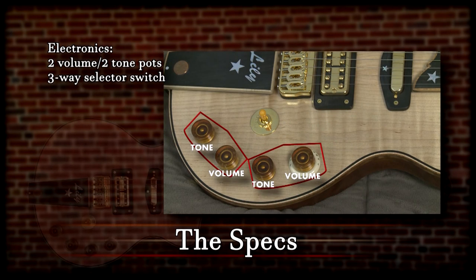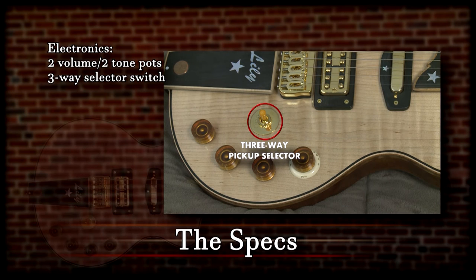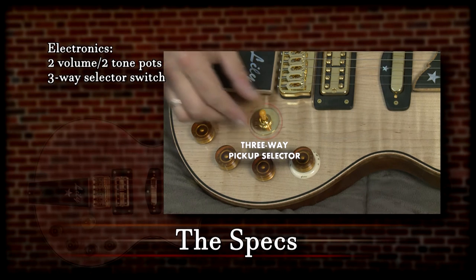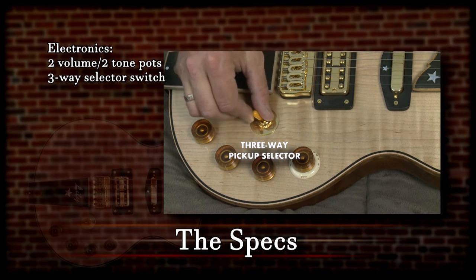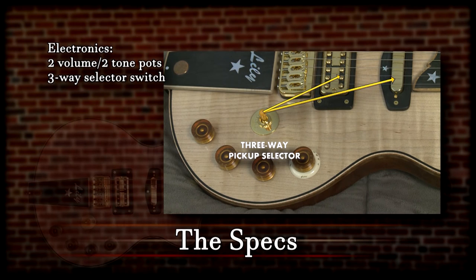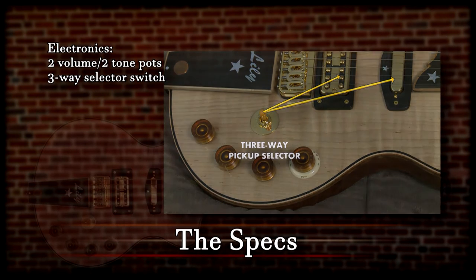There are two volume and two tone controls, a set for each pickup. I used a standard three-way selector switch for quick switching between pickups. Full forward is neck pickup only. Full back is bridge pickup only. And a middle position selects both, blended with the two volume controls.